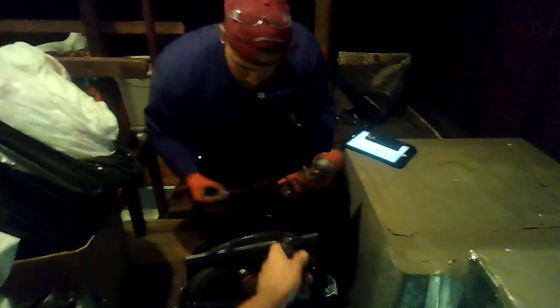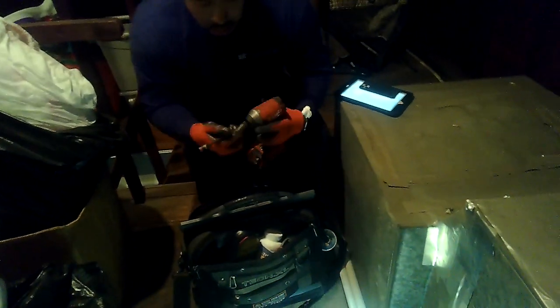All right, our evaporator coil, I don't know if you could tell by the video, has some dirt on it, but it's not filthy and it's not dusty. So let's get the drill with the quarter inch driver. Let's test the capacitor on the fan motor. And I would like you to go outside and pull the disconnect for the condenser. I want to turn this back on. I just want to get a sense of what's going on up here.